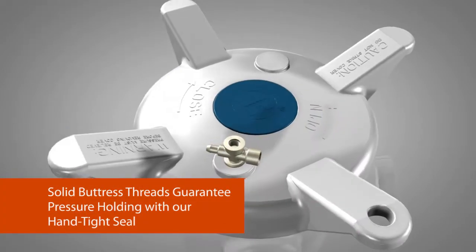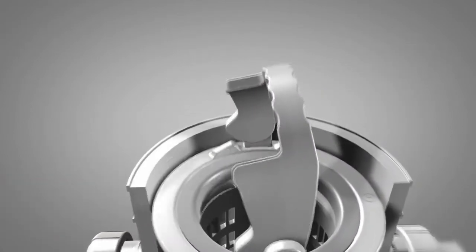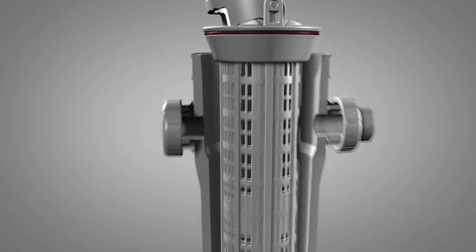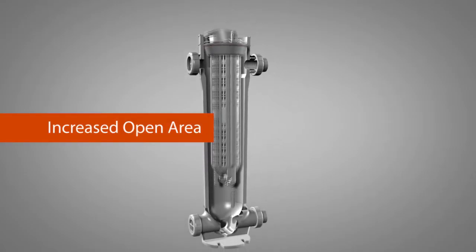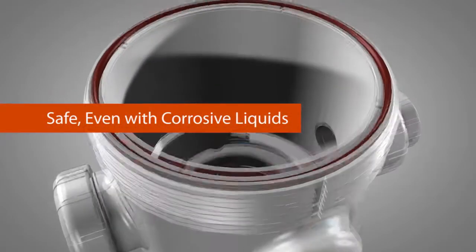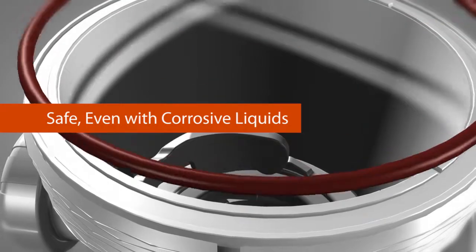The handles are raised to protect the included vent valve. The basket features an ergonomically molded basket lockdown handle, basket retaining ring, and vertical flute slots to prevent bag catching and allow for more open flow area. In addition, the filter body has a self-draining o-ring groove on the outside threads, which directs overflow back inside the filter.